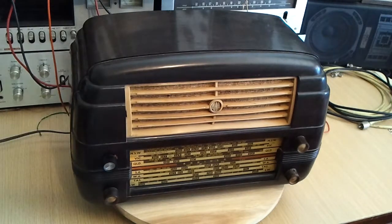It's not sounding too bad, but there's still a bit of work to do on it, and it's about 40kc out on the dial, so the local oscillator is going to need a bit of realignment at least. There was a 527MA as well that didn't have shortwave on it, but this one does.